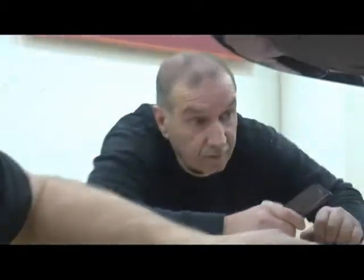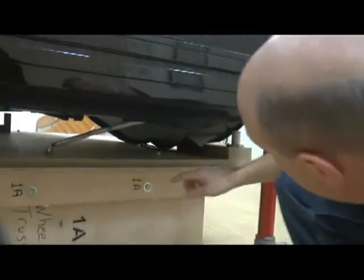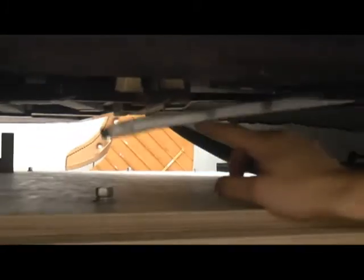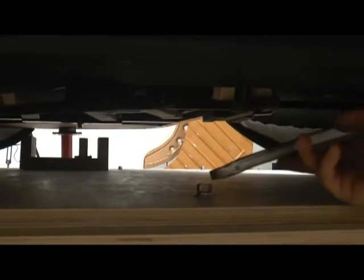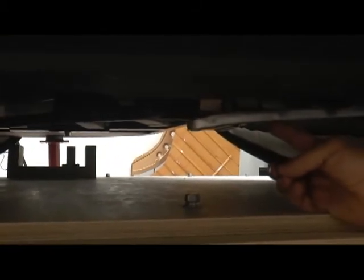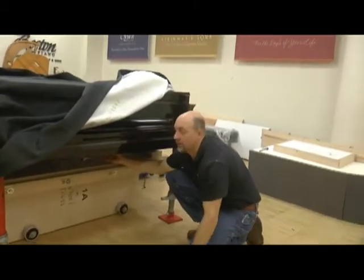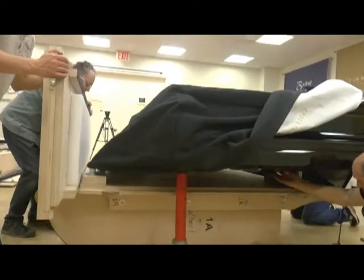On the front of the piano, the aluminum fixed by the bolt that can't be removed must clear all the trap work and blocking underneath the piano. Also, the arm that hangs below needs to be held up as you roll the crate in and out from underneath the piano. The main concerns are this arm and the two aluminum stanchions sticking up high. With one person watching the front, you should be able to roll your crate out from underneath. As they pull out the crate, the person in front holds up the upper part, watching fingers and blocks.